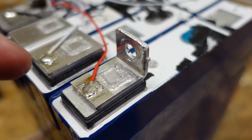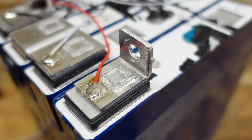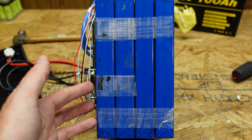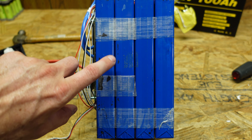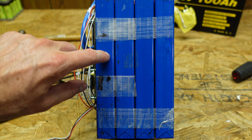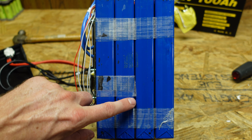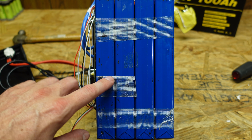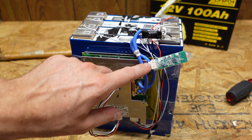The bus bars are made of aluminum and are welded very nicely down to the battery — those square patterns are the welds. There's a separate piece of material welded on top of the bus bar where the balance lead is soldered; it's either nickel or steel. The terminals connect via a piece of aluminum bent at a 90 degree angle. Looking at the side profile, the cells are not swollen or bulging. There's a thin rubber or neoprene separator between each cell, and they're all held together with fiber-based tape that prevents the pack from expanding.